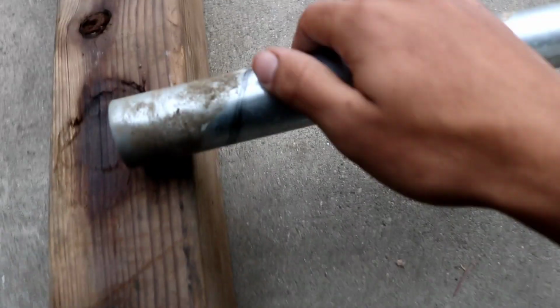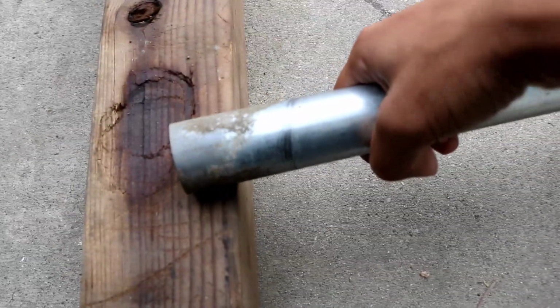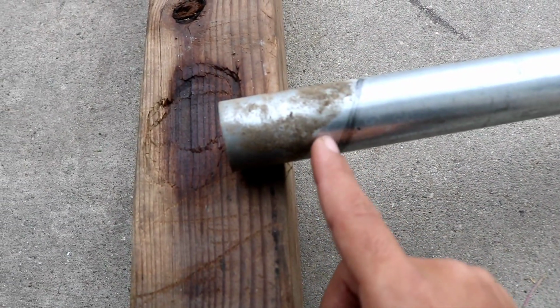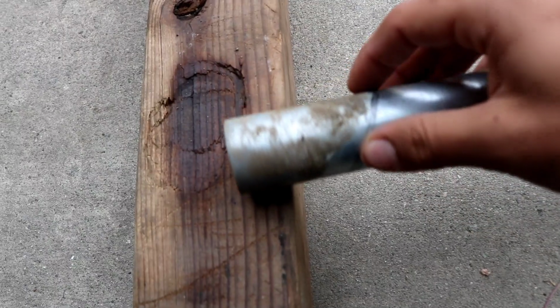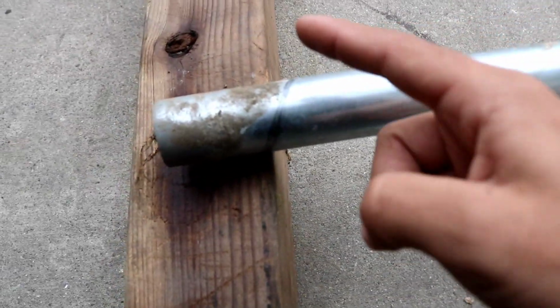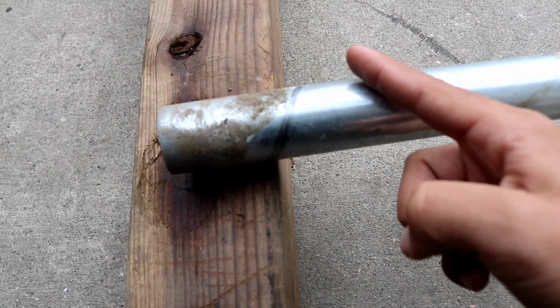I measured 2.5 inches from the wastegate out, the wastegate being right here. I'm going to do the angled cut right there, which is what I have right here. I just quickly drew it with a pencil to get a reference point. If I need the angle to be greater, I'll shave some off the bottom, and if I need a smaller angle, I'll shave some off the top to straighten it out. But I think I'm going to do another one the same, just an opposite cut.